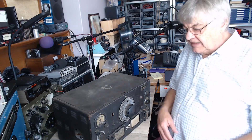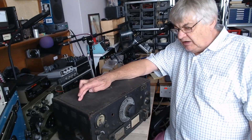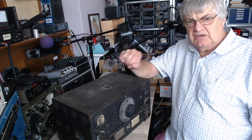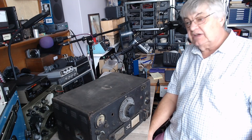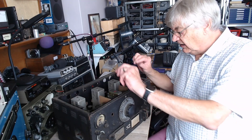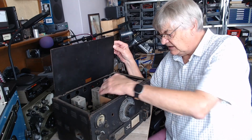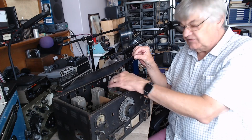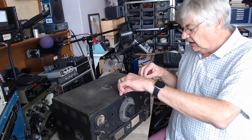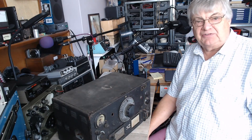So with the manual and the circuit, I've now discovered that the one I thought was the audio output valve should be the 6V6, and it's actually a double triode — an audio double triode. I can only assume the top cap leads have now been connected to the grids of the valves. They've gone underneath the chassis and to whatever pin is the grid. Why has someone done this? It really has confused everything.